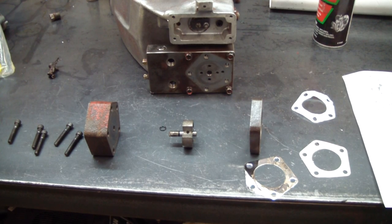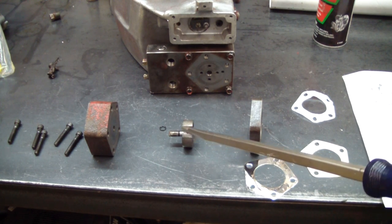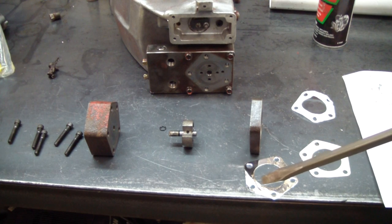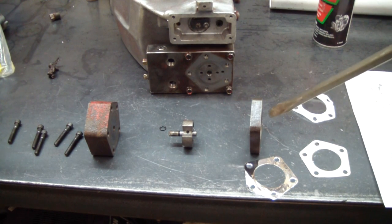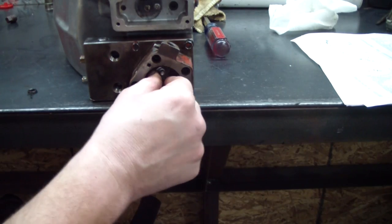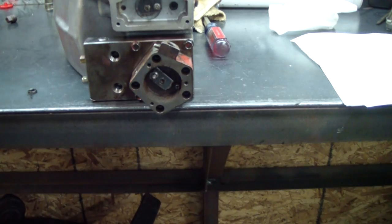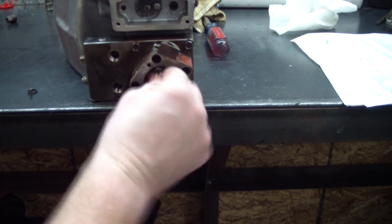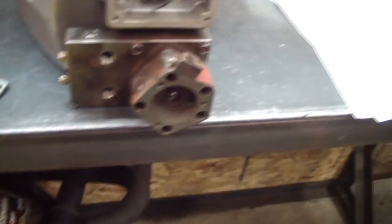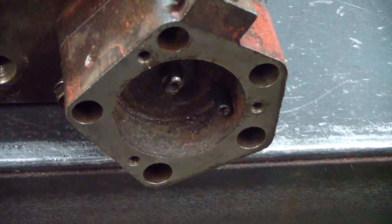I'm getting ready to put the rest of the valving together and I'm going to have to wing it because I don't really have good instructions on this. There's a rotary valve in here with an o-ring, so that'll be replaced. I'm going to put the silver gasket between these two pieces and the tan one between the end piece and the block, then crank it all down to spec. This is one of the points where it was leaking before. There's a chance I might have to flip this valve 180 — not sure, it might work both ways, but it does move and feels fairly tight. There's a spring and a screw that holds the arm on, and inside there is a pin.